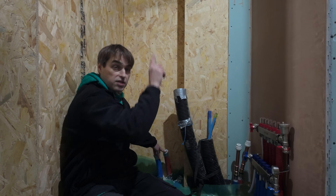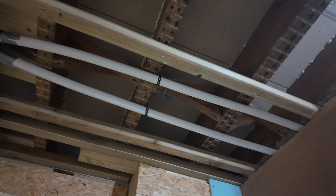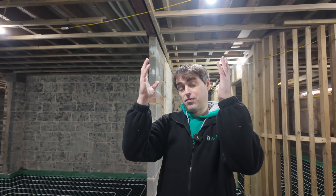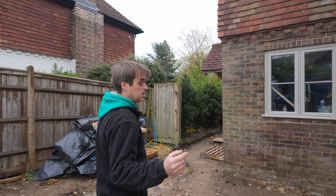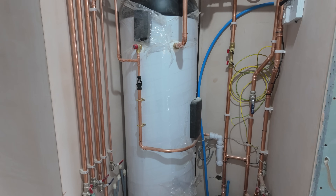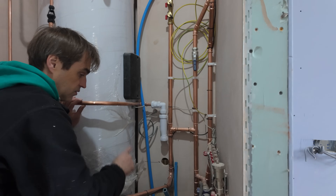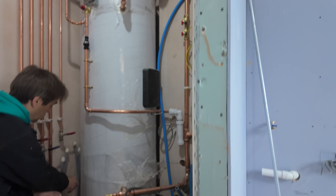The circulator in the outside unit will pump through this flow to the diverter valve, and that diverter valve will just go to this manifold and through that pipework. That pipework is 28mm copper going to 32mm pre-insulated MLCP going under the insulation to the other manifold and upstairs manifold. We've also got 32mm MLCP in the ceiling going across to the landing upstairs — it just sticks through the floor right now with no manifold there yet. We haven't been here for about two months and we missed a major part of the video — we were just too busy to record it. We installed the heat pump and the plant room, so the builders have heating on the ground floor, it's screeded and it's all running.